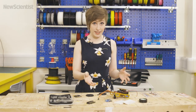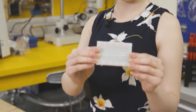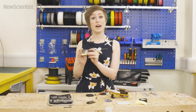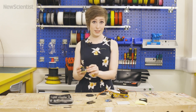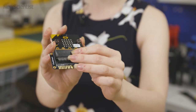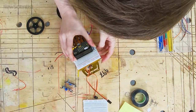We've got quite a lot of wires going on already. We're going to need some way to organize those and to make them connect to each other, and that's where our breadboard comes in. Next we're going to take our microbit, which is going to be the brains of BiscuitBot. It needs some instructions to tell BiscuitBot what to do. I've already done that, but if you have any trouble programming your BiscuitBot you can go online to our website and download some example code. I'm using this cradle to make it easier to connect to all the pins on my microbit, so I just slot it in like so and then I can plug it into my breadboard which lets me access all the pins.